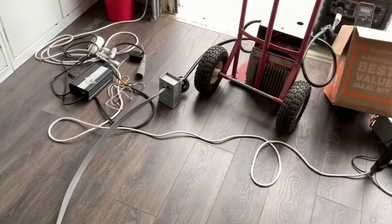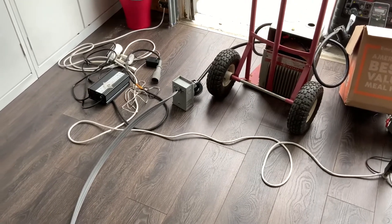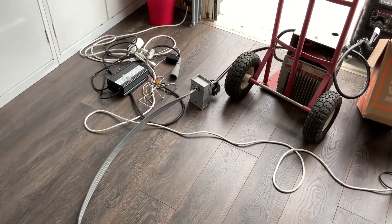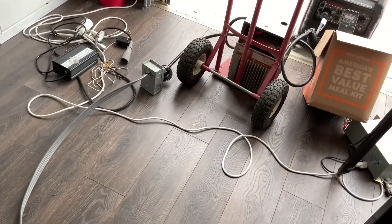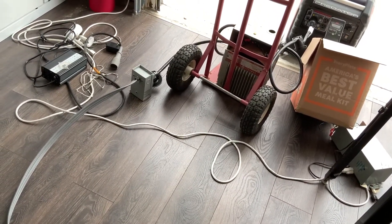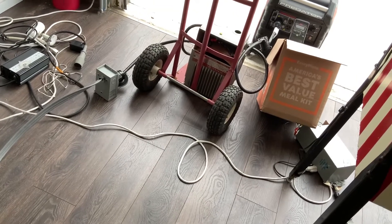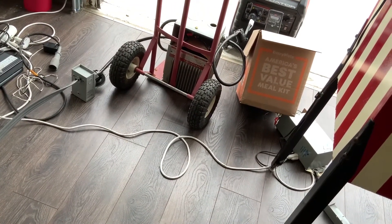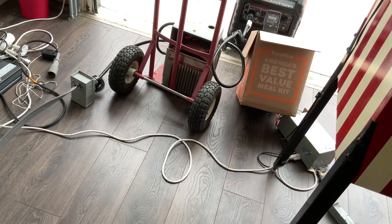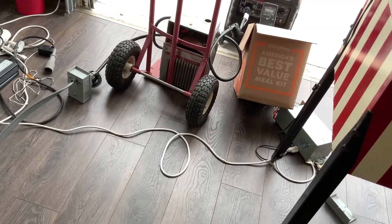We have about 1100 watts being used right now. What we're going to do is plug in the central air — we'll hit the knife switch and the compressor should kick on. The air conditioner is going to take about 1400 watts of surge, so 1400 plus the 1000 I'm running is 2400 watts. It should start it.